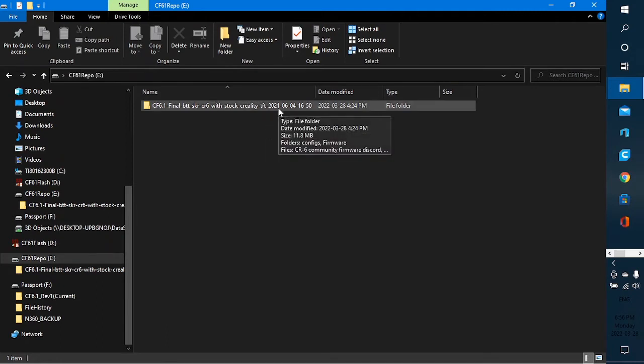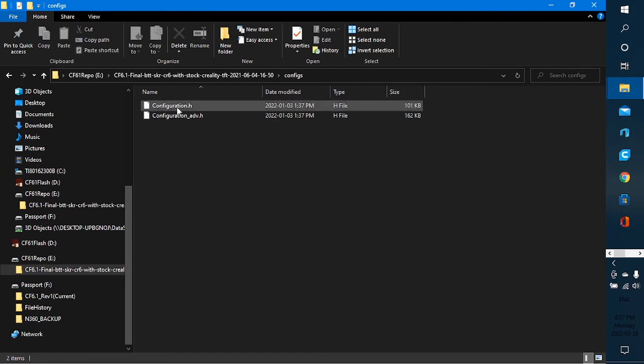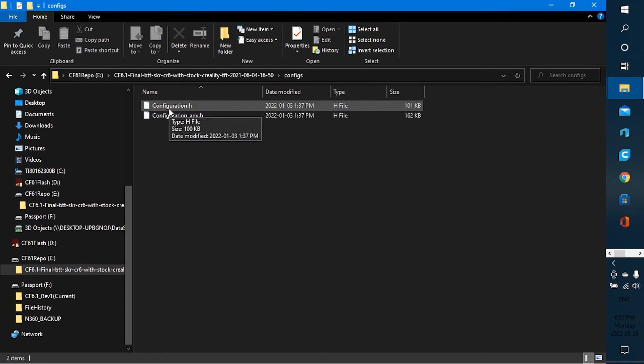This has already been unzipped so I can just browse and navigate. Take your zip file and unpack it to a folder so you can navigate into it. You will find the config files — this is where he's included the configuration.h and advanced.h that were used to compile the firmware, so you can go back and answer your own questions about what settings were used, which switches and features were turned on, and what default values were established. If you wanted your system to be any different, you would have to recompile the firmware yourself.